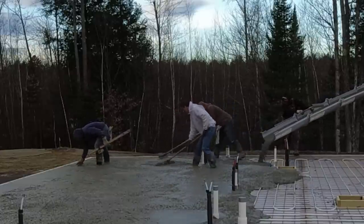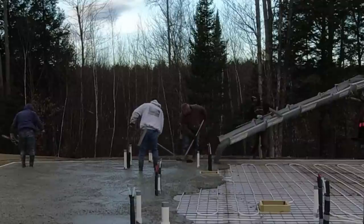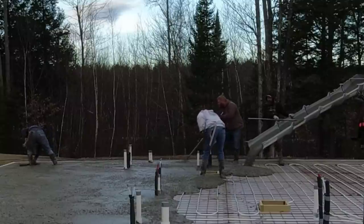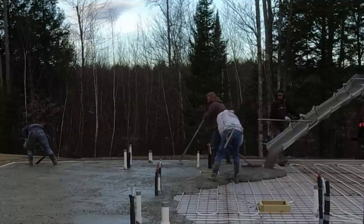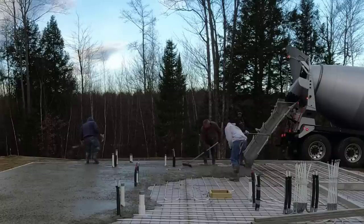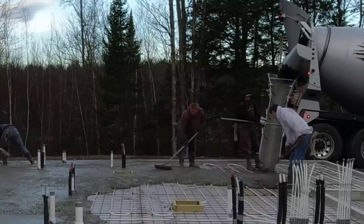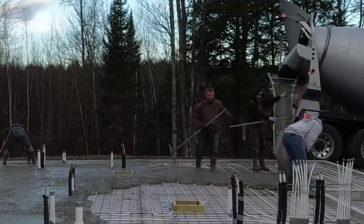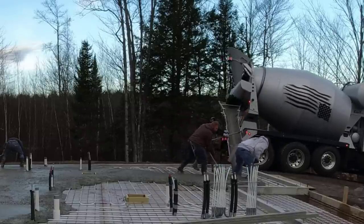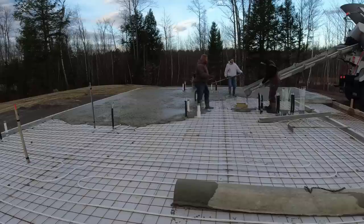This will be the pour video and I'll have us finishing all these floors - the house, garage, and entryway - on the next video. So if you haven't subscribed yet, go hit subscribe to see how we finish with power troweling, wiping out some by hand, broom finishing, and the sawed joints. Right now Darren's on the left magging the edges, Luke and I are tuning in the concrete - getting it as close to level as we can - and Harvey's holding the chute, controlling the concrete speed and the truck position. This works really well with four guys, especially on something this size.